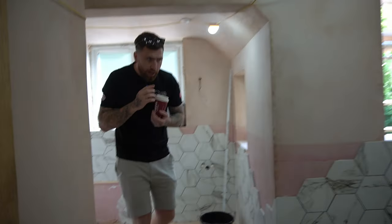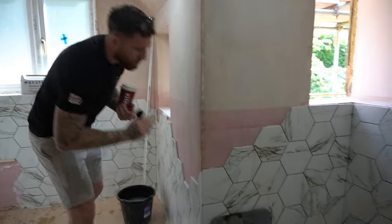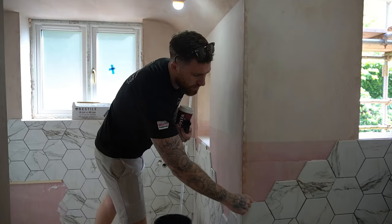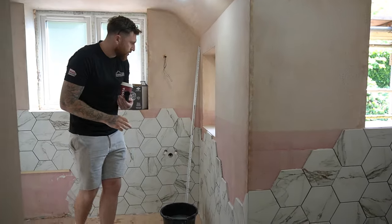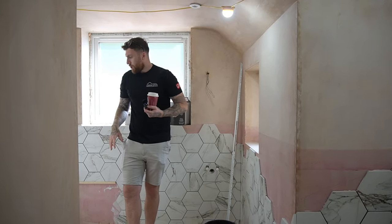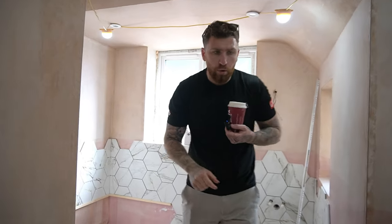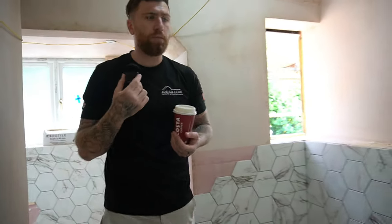Family bathroom. So we have our hex and tile detail, as I spoke about, coming round, dropping down. We need to grout in these edges and get them finished off nicely. We have stone window boards going on. Bath going in here, so tiling is complete now. We just need to grout. We'll take a look at bed four ensuite because they are my favourite tiles of the build.